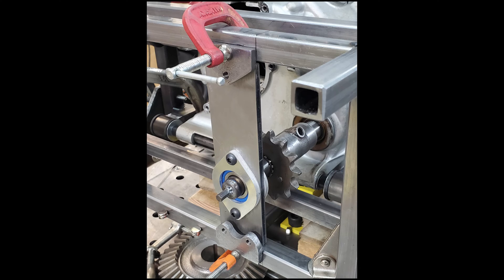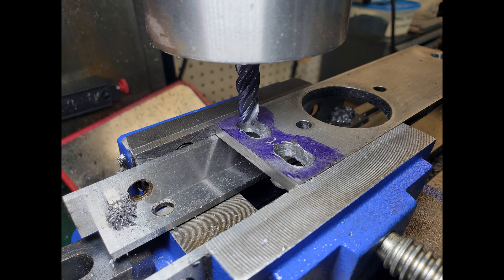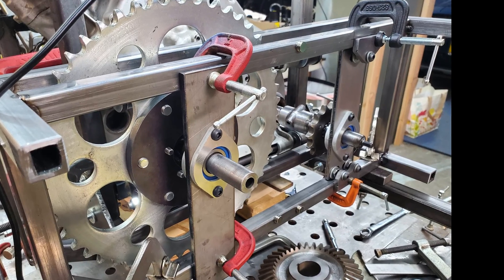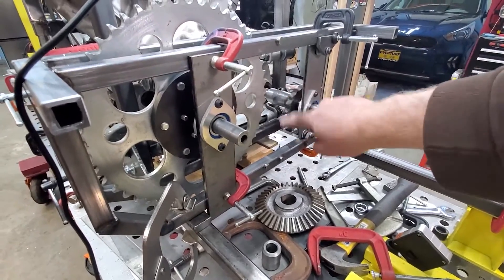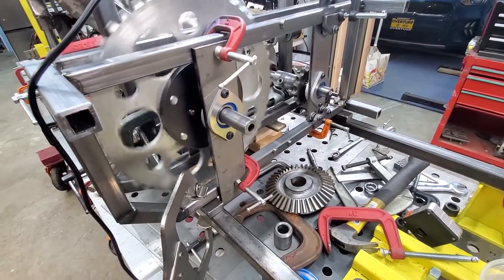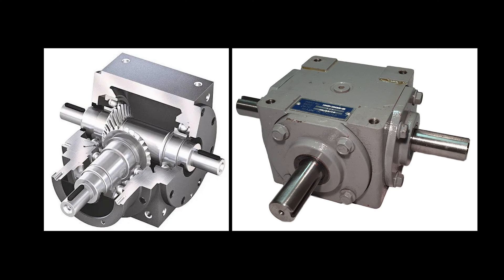Fit testing looked pretty good, so I went ahead and cut the grooves in the plates. I went ahead and marked the plates and cut the grooves out on my small milling machine. The result came out looking pretty good. Fit testing it with the bolts, washers and adjustment nuts installed, and the brackets clamped to the cage also looked good. The reason for this adjustability is that the bevel gears require quite precise alignment to ensure a decent amount of efficiency. Normally the right bearing recesses would probably be machined at right angles into a cast steel housing, but that's outside my fabrication capacity at the moment, so I'll go with these adjustable brackets.